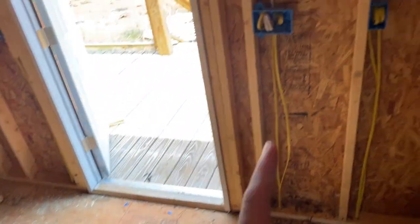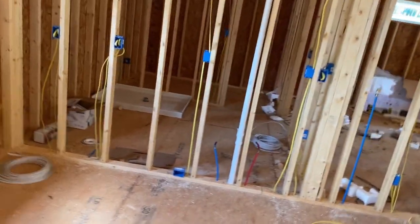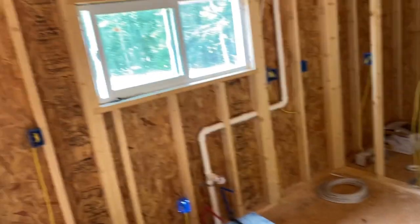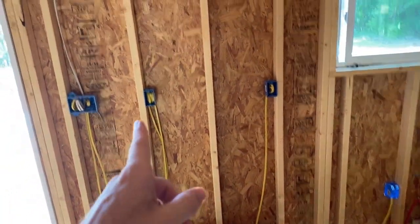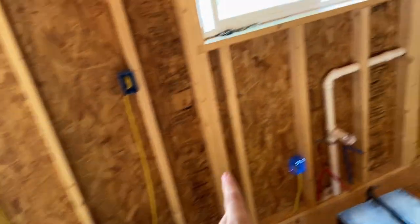So we came to the plugs first, from the box to this plug, because kitchen appliances like toasters and whatnot run a lot of power. So Dad only puts two per circuit. We did two plugs, running from the box to that one, and then jumping to that one. That's one, and then one wire to the dishwasher.